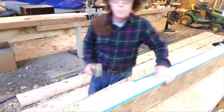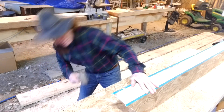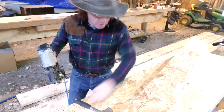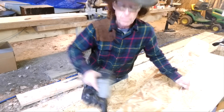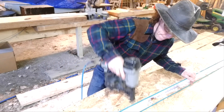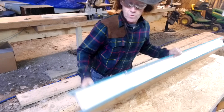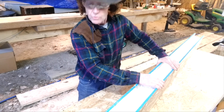Just using a sample piece of 2x4, and we want that to be pretty darn flush across there, because the skins are going to be in bearing when they sit on something. I'm going to use a pneumatic roofing gun to nail my perimeter pieces, about every six inches on center. That's the basic premise right there — each edge and perimeter of every opening in a SIPs panel has to be filled with nominal dimensional lumber.